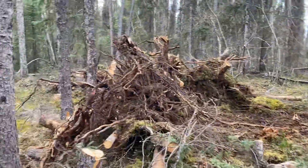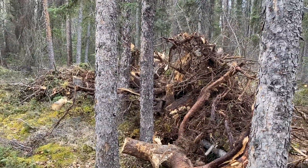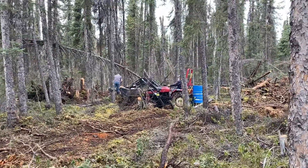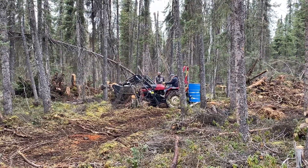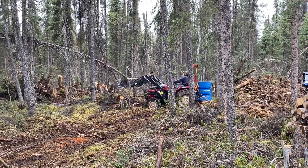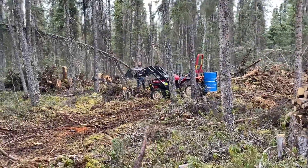All these stumps that we're piling up here — I'll bring the chainsaw down tomorrow and cut a block of wood off almost all of these. We had to leave them tall in order to get a hold of them with the bucket, to be able to pull them. If you cut them off even with the ground, you really just have to dig them out. But if you leave enough on top for the bucket and the thumb to get a hold of, you can pull them out a lot of times. That's why you see all the stumps left tall like these — because if you don't, you can't go back and pull them later.